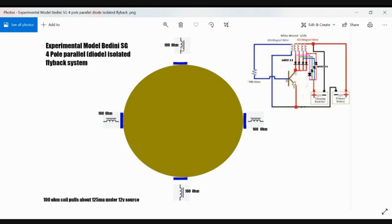Another thing about having oscillating coils, even this close together: if you have too much current and the field is too strong, it will reach to the other coil and they'll trigger each other. Not to say that's a bad thing, you'll keep your motor running because they'll just be triggering each other, but you'll lose control over your motor RPMs. So the EMF coming off one, which again shouldn't matter either because they're all getting triggered at the same time. So I take that back.